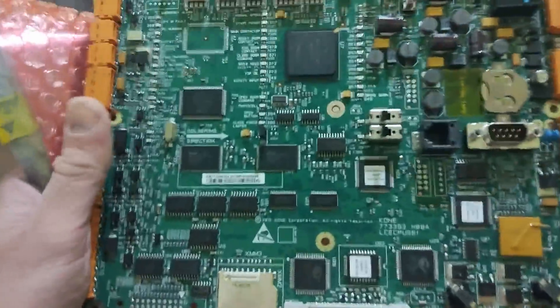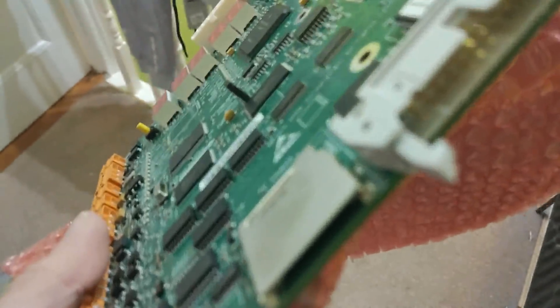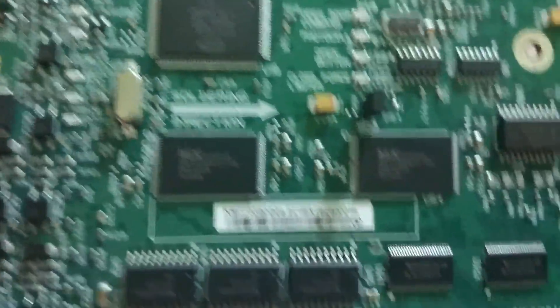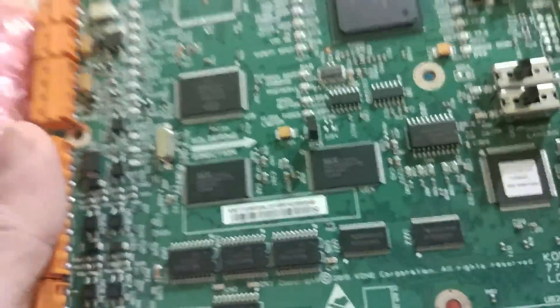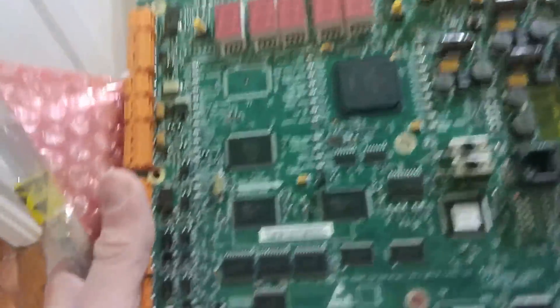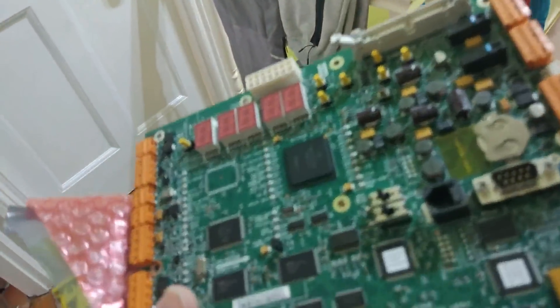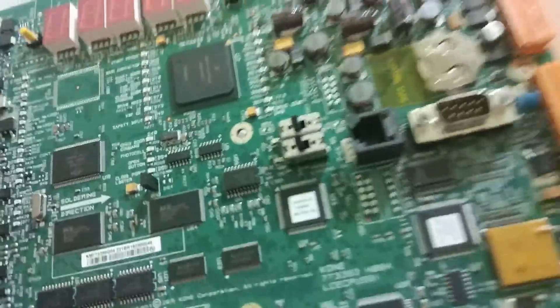So this is how to build your own EcoDisc. Let's go through how I've been reverse engineering this board. There are quite a few interesting bits — it actually has an SD card reader with an SD card in it. If you take the SD card out, it makes the lift not work. We've got the raw data off the SD card from a working EcoDisc. An interesting thing: why are these chips called NV RAM? The term NV RAM is non-volatile RAM — RAM that keeps its data when the device is powered off, in other words flash memory. NV RAM is a really old term, originally meaning a RAM chip with a battery connected to keep its data, but we don't actually know why these modern flash chips are labelled NV RAM rather than just flash memory.